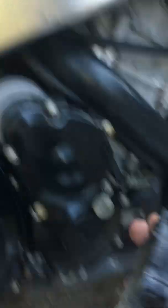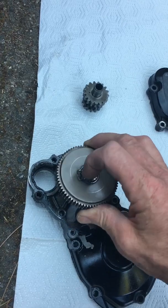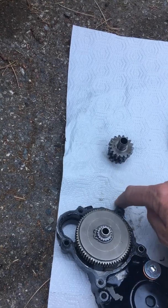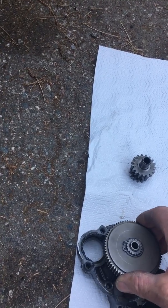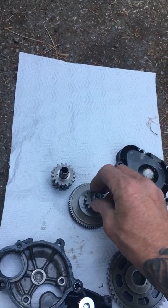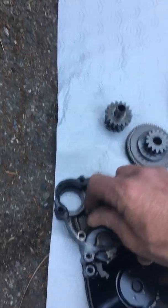With this cover off you're going to see the inside, and the idler gear comes off. It might have a wave washer in between it — a wave washer is a washer that comes up in waves so it doesn't have all contact points at the same time. I put grease on mine, that's why it's staying, but the steel pin should not walk around like this — it should be totally tight.